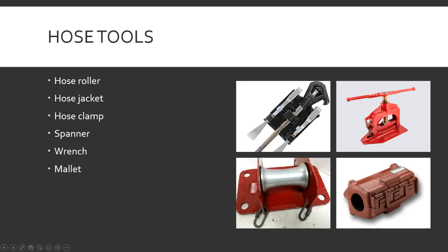Spanner and wrench — spanners are the simpler ones with a little hook on the end for connecting and tightening two-and-a-halves and attack lines. Wrenches also have the spanner hook but additionally have an adjustable wrench on them to open hydrants — you unscrew it, place it on the top of the hydrant, tighten it down, and you can open and close the hydrant.